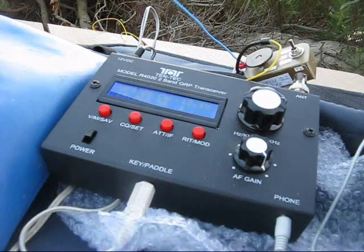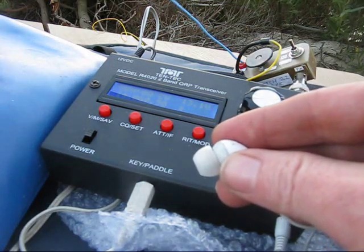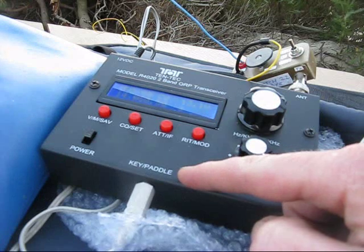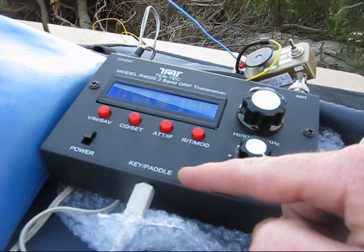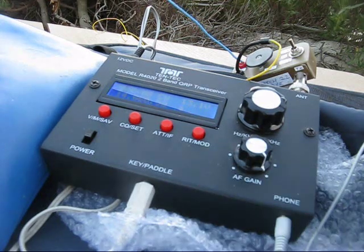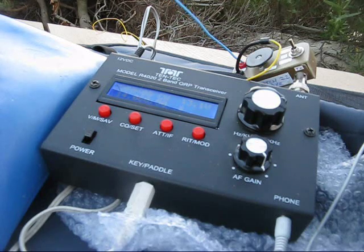What are some of the deficiencies? The volume isn't quite enough to comfortably drive a speaker, particularly on 20m — this is really a headphones-only set. There's an oddity in that you must plug in the key or keyer before turning on the power, and the automatic CQ function only works with a paddle plugged in, not with a straight key.